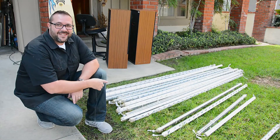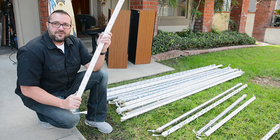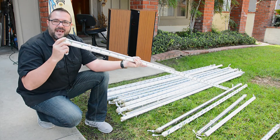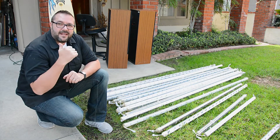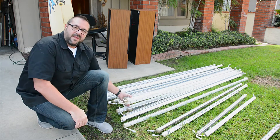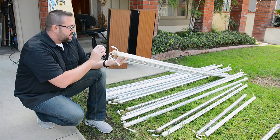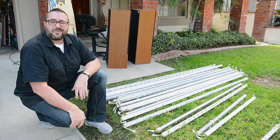We've got all our parts laid out on the grass. We've got 8, 6, 4, and 2 foot lengths. These are all modular components — basically LED tube protectors. We've got a thin strip of coroplast in there, and all of the nodes are 3 inches on center drilled through that. We've also got some end caps that are just used for real estate mailers. These are the different segment lengths we need to outline the house. It's important to note that on each channel of RGB, we can only get 4 eight-foot lengths. Whatever combination you use, it needs to add up to 128 pixels. Each 8-foot length has 32 pixels in it, and subsequent sizes have a corresponding proportional number of pixels.